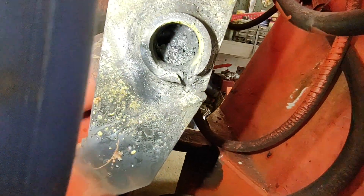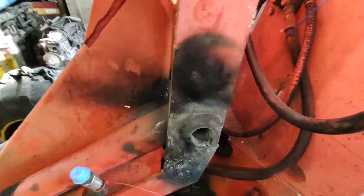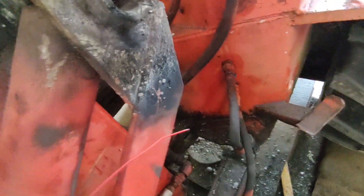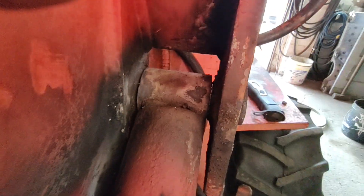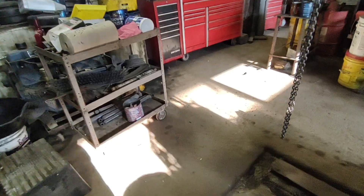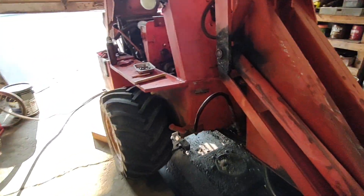That's about the best I can get. Can't cut the pins — they're hard as hell. Can't get in here with the torch, not enough room; end up destroying a lot more stuff. I'm waiting on the starter so I can't run it, can't get my lines yet. What I'll have to do is come around the other side, but I don't think I can torch it deep enough on that side because I really don't have the room to work.